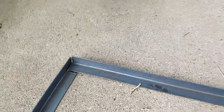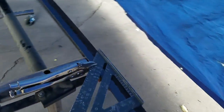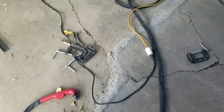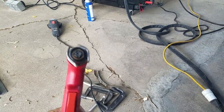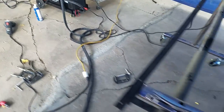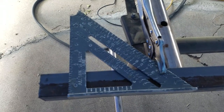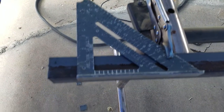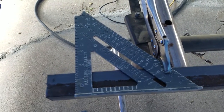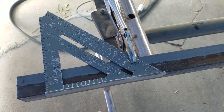What I've been doing is just marking the metal. I found out that the standoff device is a nice five-eighths of an inch away from where the cut line is, so I add five-eighths inches to the dimension I want, clamp a carpenter's angle, cut the corner out, and grind off the slag.